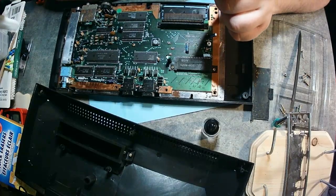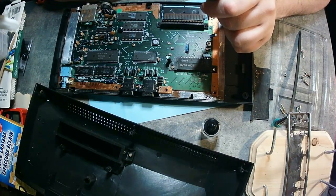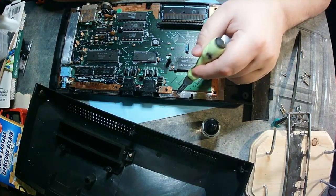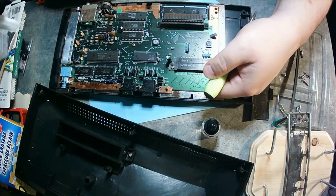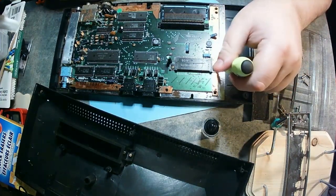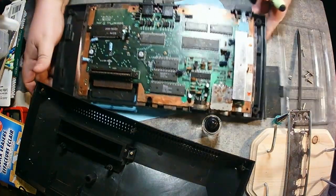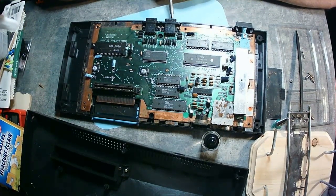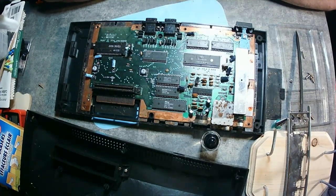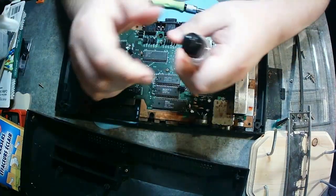Here I'm inspecting the board and looking at the chipset. I don't see any corrosion — maybe just a tiny bit around the ground plane. The whole thing is pretty scummy, but it looks pretty good for being from the 80s. I make sure there's nothing broken that I have to fix. The buttons are really spongy and not really working, so I am going to take them out and replace them with buttons that have a really satisfying click noise. Then I'll take a Q-tip to this first with alcohol.